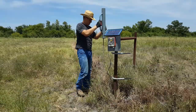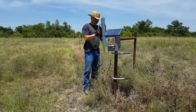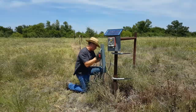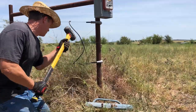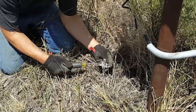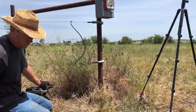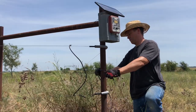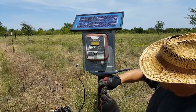Now I'm going to install a grounding rod. One of the biggest problems with an electric fence is having a bad ground. This is just a clamp that you use to connect the wire to the grounding rod. The ground is so hard I can barely get a screwdriver to go into it. This is some aluminum insulated electric fence wire — for a roll of it, it's pretty inexpensive. Here I'm connecting the conductor that goes from the grounding rod to the fence charger's ground.